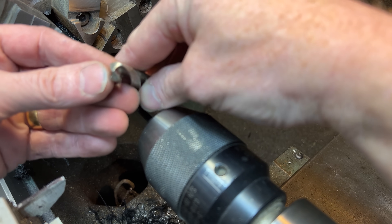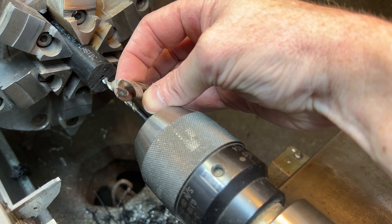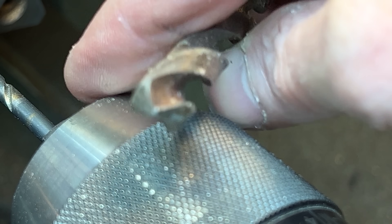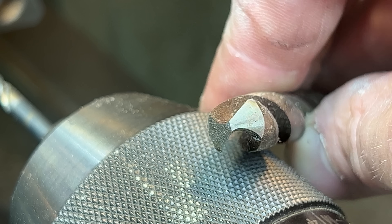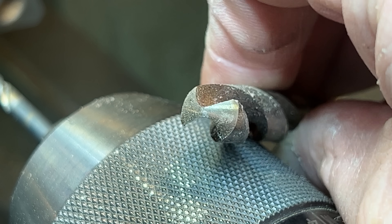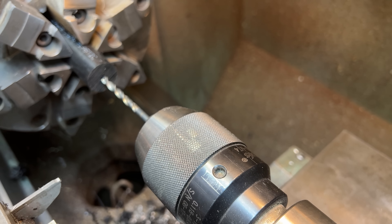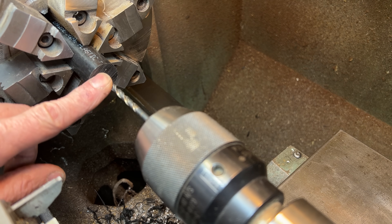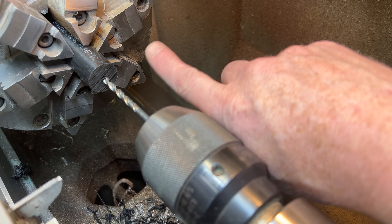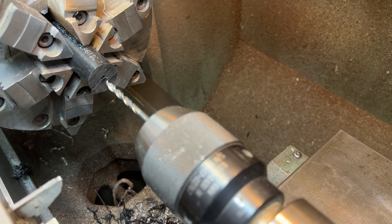Here's a big one and here's a close-up of what it looks like. That's the tip of your standard twist drill. It's not great for starting a center hole — in fact it can wander quite a bit. If you're trying to go into material with just a drill bit like this, what you often see is that the moment it hits the material it starts to do a little bit of this, meaning it hasn't gone in perfectly centered.